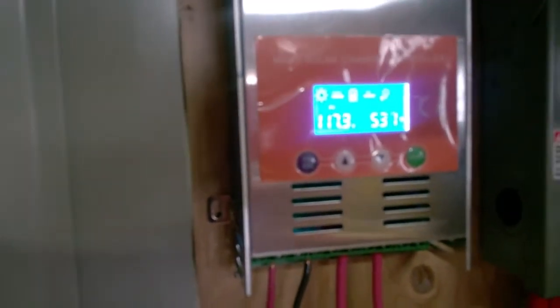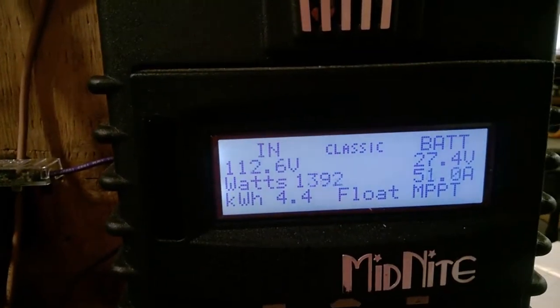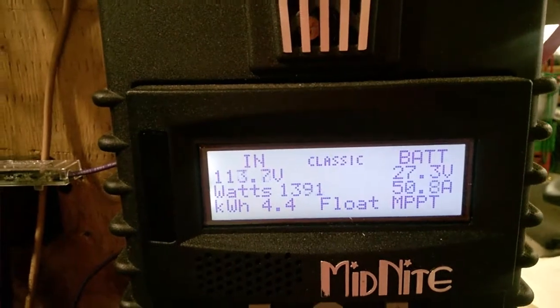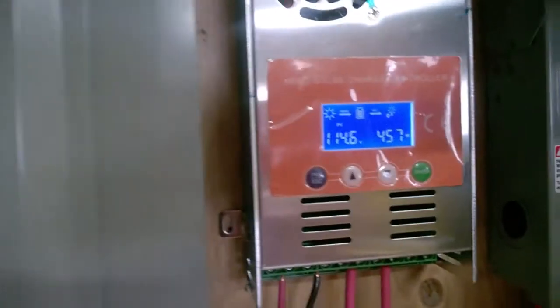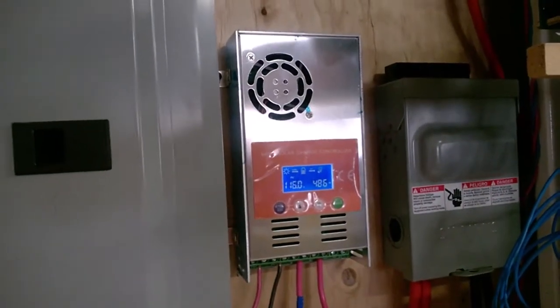It sucks a little wattage right down. Okay, so I have a way to keep that from getting crazy — I just have to pull a little bit off it. Now I'm pulling 1400 watts off my panels. This one's first in line, it gets the first shot at the current. So it'll pull enough to run that heater — 800 watts — plus the 500 I was running, and then it pulls down my wattage to a level where the fan should go off. Seems to be working. It's not a great system; you have to come up with something a little better. Thanks for watching.